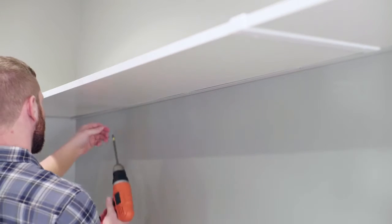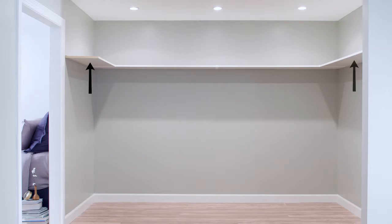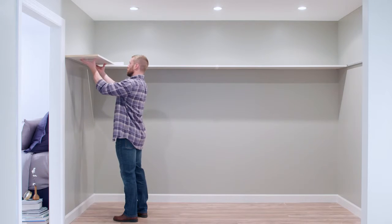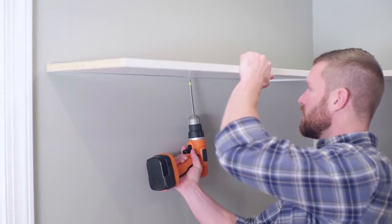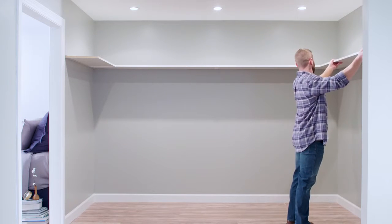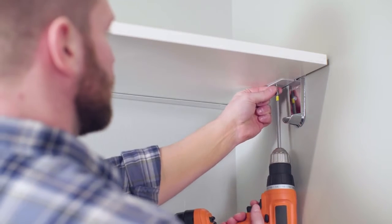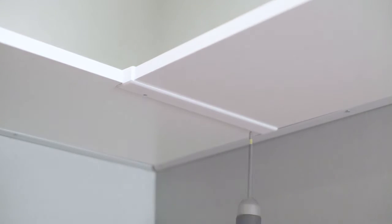Use at least 6 screws for every 8 feet of shelf, and fasten the joiner to both shelves. Now for the two sidewall shelves: measure and cut both shelves to size, allowing 1 eighth of an inch space for the corner H channel. Insert the cut shelf into the back channel, then insert the corner H channel between the two shelves. Fasten and secure the shelf to the back channel, then secure the corner H channel to the shelf. Slide the next shelf onto the sidewall bracket and back channel, insert the corner H channel between the two shelves, then fasten the shelf to the sidewall bracket and back channel using number 6 by 5 eighths inch wood screws. Secure the corner H channel to the shelf.